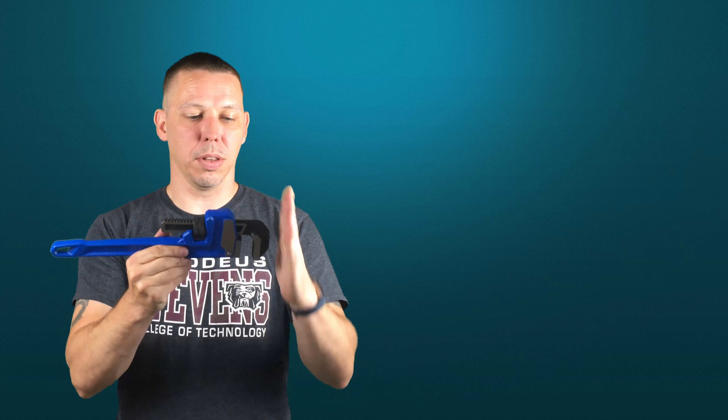These are classified by length — this one says 14 inch. Depending on the manufacturer, some go by the length of the handle and some go by OAL, or overall length. If a listing says 14-inch OAL, that's from the very back of the handle to the very top of the hook jaw. Other places will say a 10-inch handle, meaning just the handle portion, so the overall length of the wrench would be longer.